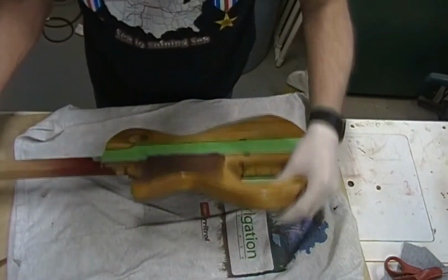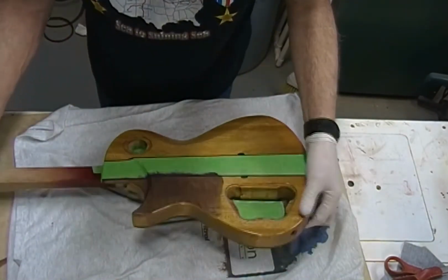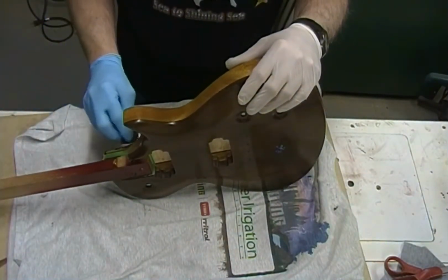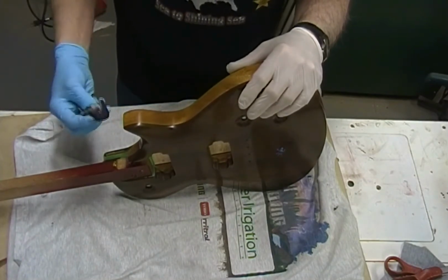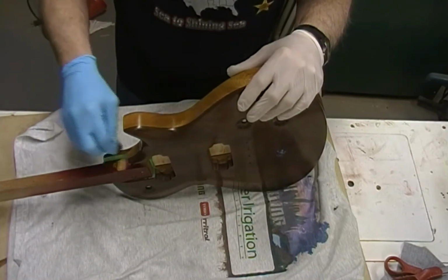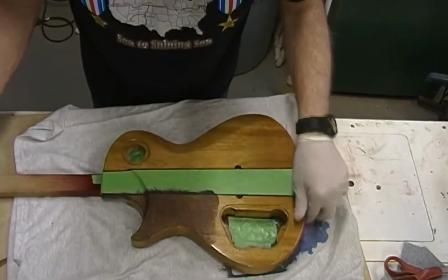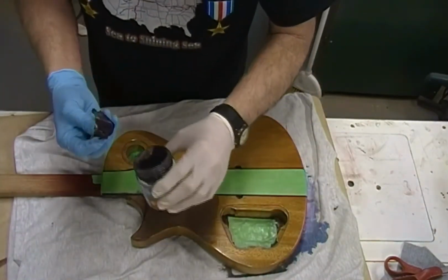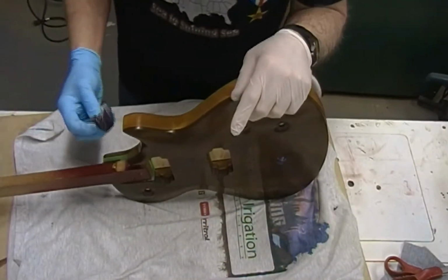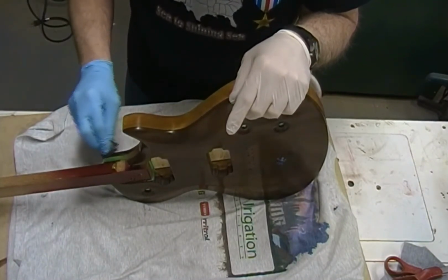That's actually because of some of the experiences I've had with trying to fill up mahogany or coarser woods like blood mahogany and Padauk. Padauk is a booger. Wenge just has tremendously huge pores, and I've wrestled with some of those guitars for quite a while getting the grain filled. This was with the other types of fillers, and it may just be that those particular instruments or wood species are real boogers to fill, but I ended up oiling a couple of those.